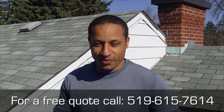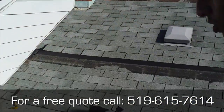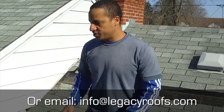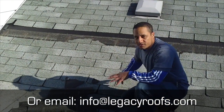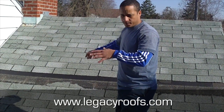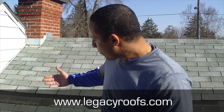We've come up to the roof — take a look at how it looks. It's a relatively small roof, around 14 by 14, but we have some pretty important details. This shingle detail here is where most of the problem is. On one side is a garage, and on the other side is interior living space, and inside they're getting water throughout.